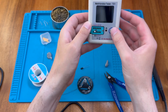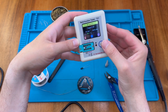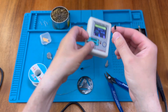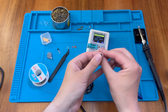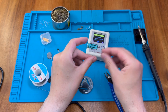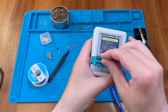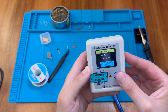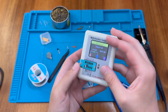I've got it in terminals one and two and press the button. This one reads 55 microfarad, which is perfectly fine for a 47. Short it out again, then short out the other one and test that as well. This one comes out as 54.9, so very close — very well matched.